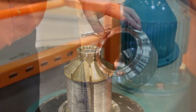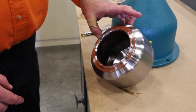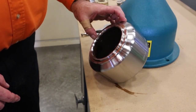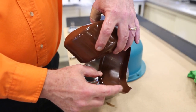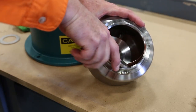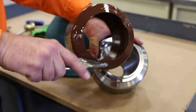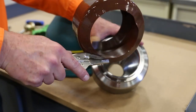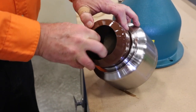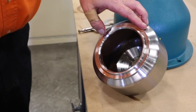The solids removed by the centrifuge will accumulate on the outer side of the bowl top. Removable and reusable sludge liners are provided to capture these solids to make cleaning and removing solids easier. The liners are split to make them easy to remove and install. Use a thin screwdriver and a pair of needle nose pliers to grab an end and twist while pulling it out of the bowl. The solids will be in the form of a sludge. Scrape the sludge from the liner and wipe clean. These liners can be reused until they crack or break.